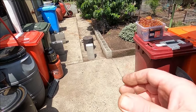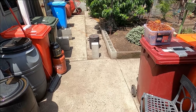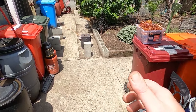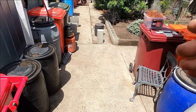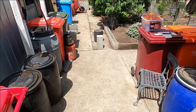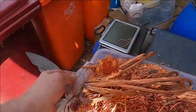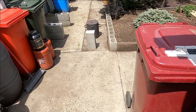And don't forget that the melting temperature is less than the pouring temperature, so you need it even hotter than copper melt, because if it was just at melting temperature, by the time you took it out of the furnace and started pouring it, it would be too cold. It would start setting again. By the time you take it out and start pouring it, it'll go from 1220 to about 1150 within 30 seconds. So that's why some people get confused and think melting temperature is what you need. It's actually pouring temperature, which is probably 40 or 50 degrees more than melt.